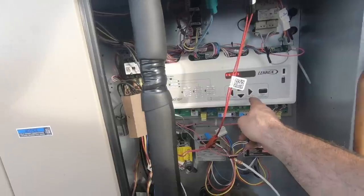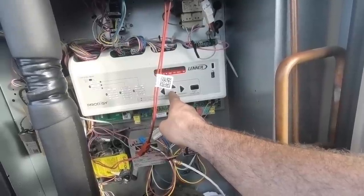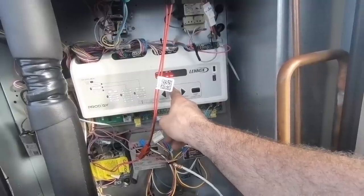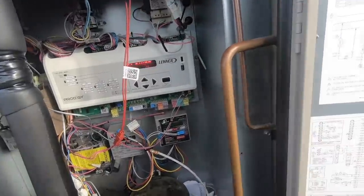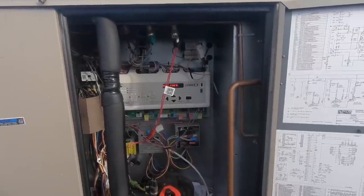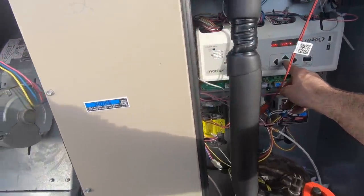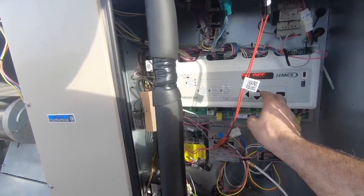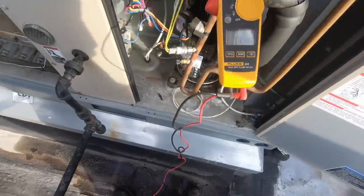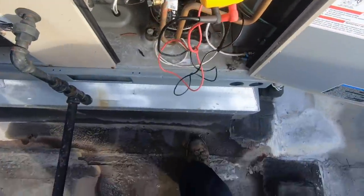Going into the service menu: enter, test, enter menu, guided — blower, fans, cool, heat. Let's start with the blower relay first. Enter — blower high — this is the blower high contactor, blower is off. It won't let me move through. We tripped — something in the control or the blower relay.